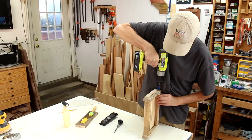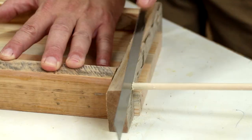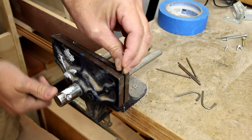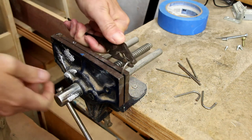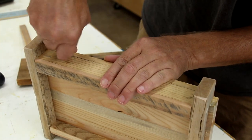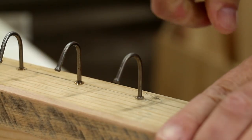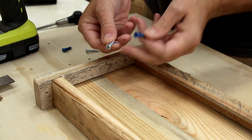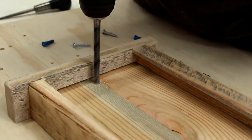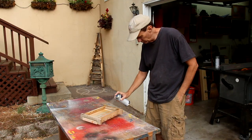These dowels will give those joints a little extra strength and add a decorative element. This is a quarter-inch dowel I'm gluing into these holes. I'm bending these nails into hooks. I've pre-drilled holes in the bottom of this and I'll epoxy these nails in. I'm going to attach this to the wall using plastic anchors and screws, but I need to set the head of this screw below the surface of this board. Now I can drill a smaller hole all the way through. I'm finishing this with spray lacquer.